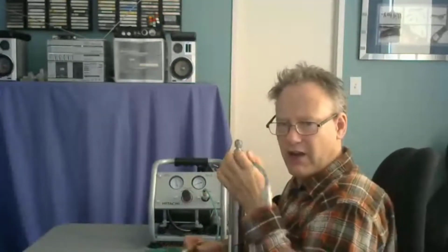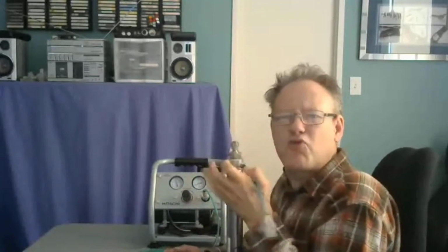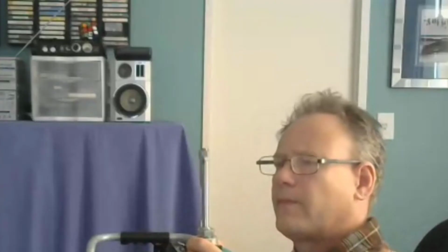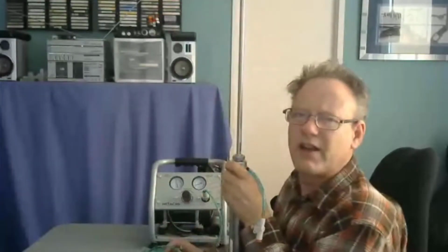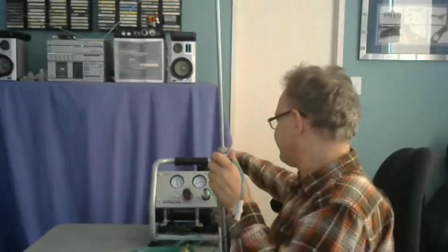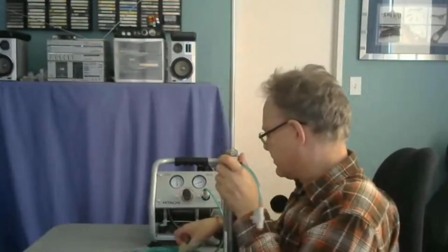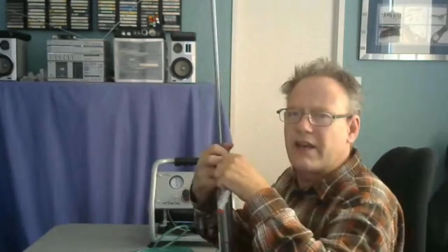So it's going to extend, and I've got my meter valve here, and we're going to see how it extends. I'm throttling it. Okay, and now we can see the speed is pretty slow. The reason it's changing its speed like that, so the compressor came on, we just let it go. Actually, I can turn it off. It's at 100 psi. All I need is 10. The reason it was moving like that really slowly is because the air was getting compressed.